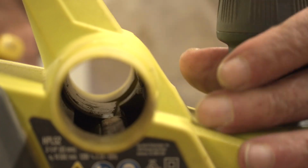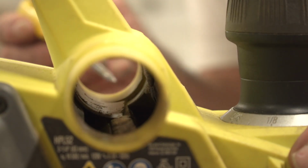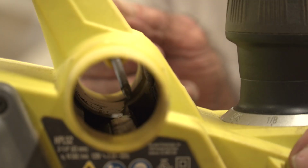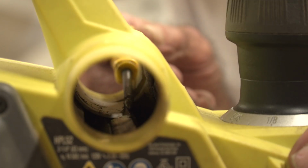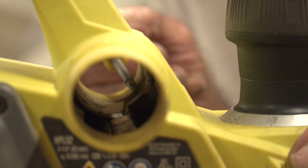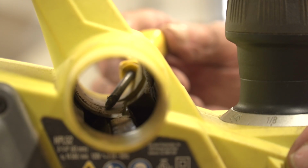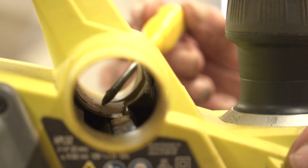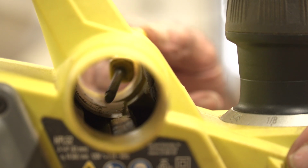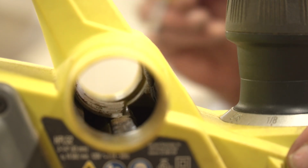Okay, like that. All right. Now on this one here, you can see that I've squared out the corners of the hole that the chips fly up in by just reaching in there with a chisel and chewing at the corners of it a little bit. And the other thing I've done is the air slot is the same way. The air slot had a diagonal kind of a blockage on the end of it right here and one on the other end over there. So I didn't like that and I squared those out.